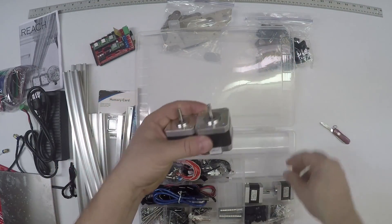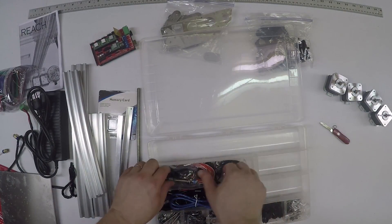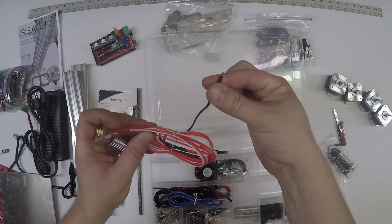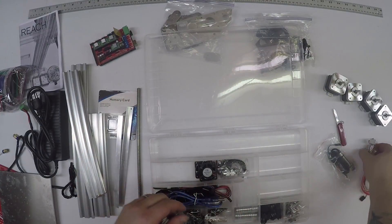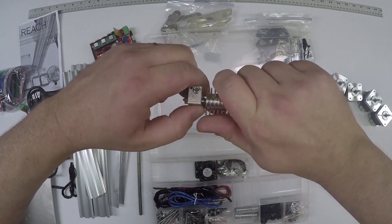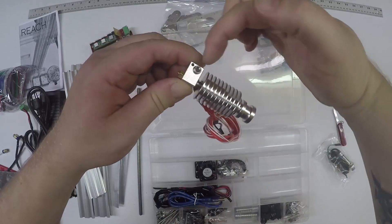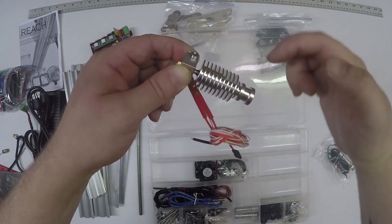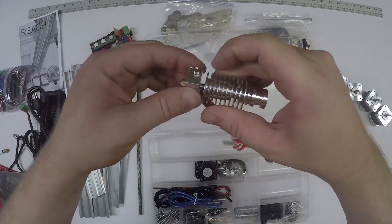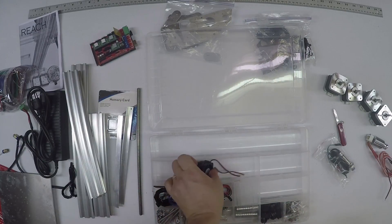You got four stepper motors - these should all be identical, should be no differences. You should have a proximity sensor, hot end, thermistor, and this is your power wire. Double check that your thermistor looks okay - this can be a problem. Make sure this is tightened up pretty tight: you want to make sure that threaded barrel inside is snug against the brass so those two meet inside the block. Just make sure it's all snugged up so it doesn't leak right off the bat - that's terrible when it starts leaking in the first 10 minutes of a print.